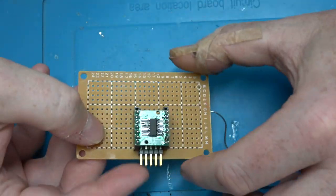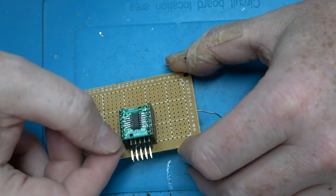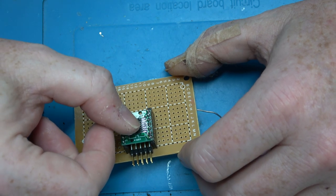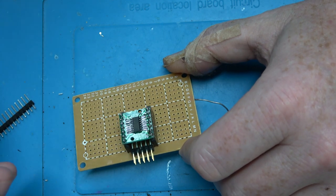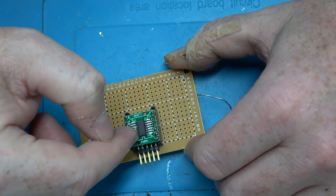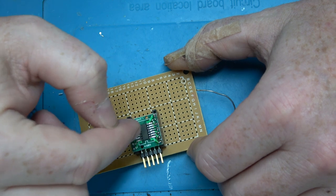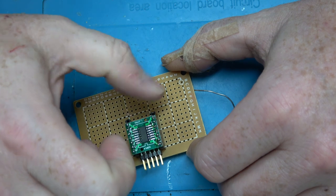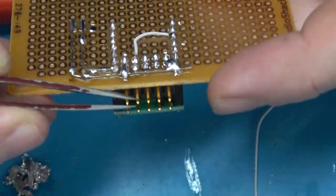So that's what I want to do with this. We shouldn't need any additional circuitry. This chip has a SPI peripheral on it, and if we operate it in slave mode, this will be the slave to the Nintendo, which will be the master. It's hardware based, so we don't have to use any interrupts, aside from the latch. So the Nintendo can latch data out of this chip at its leisure, and the rest of the time this chip can pull the data using bit banging off of the three controller ports.